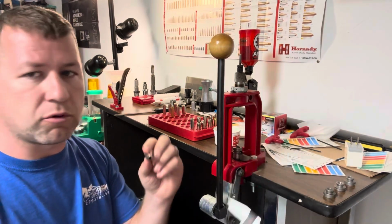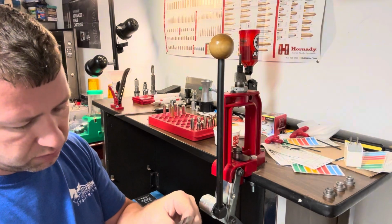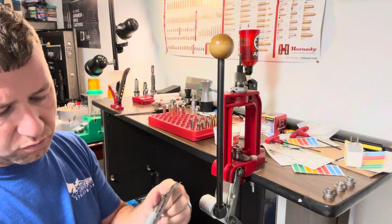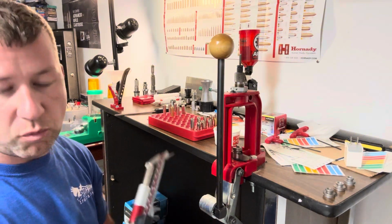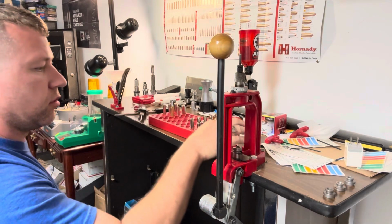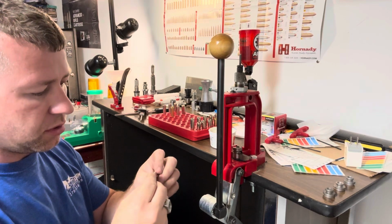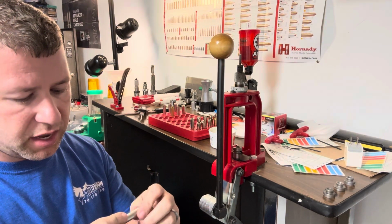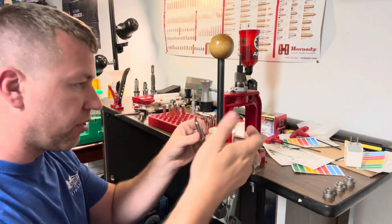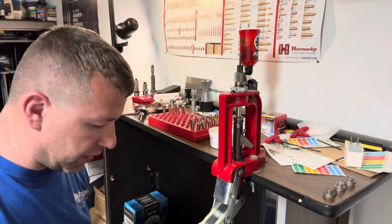this Federal brass, it's nickel plated, but we'll see with the comparators, we're at like 1.571 is what that's saying. So I'll get some of this Hornady Unique case lube to put it around the neck, shoulder, and on the first part of the body. Rake a little excess on the mouth. It helps it slide a little easier on the decapping pin.